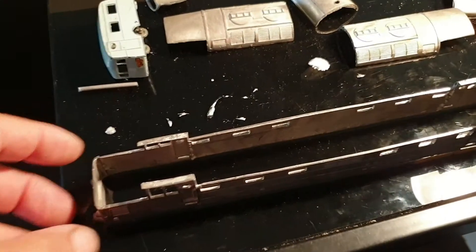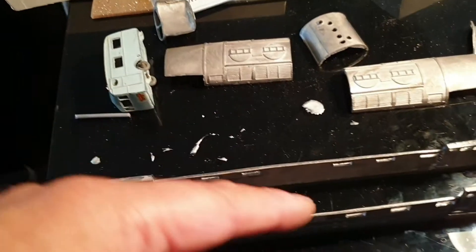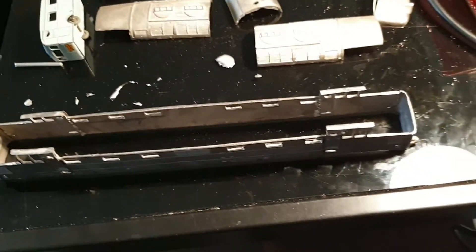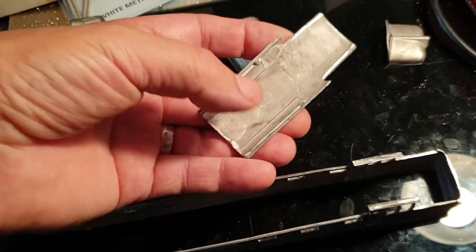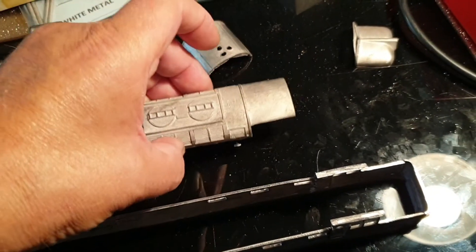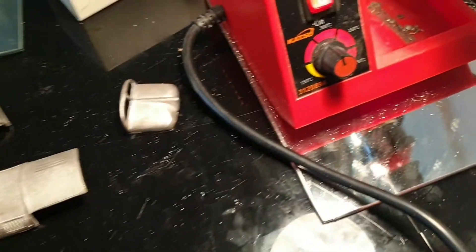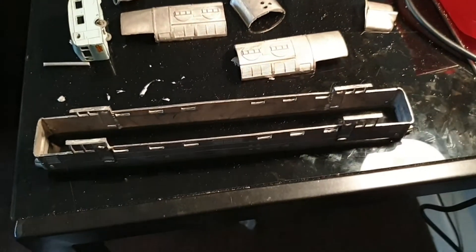I've now actually soldered all four corners with tacks and it's all nice and square, level, flush at the sides, and nice and straight right the way through. I used this just to support the center of the body as I soldered the ends, to stop it from dipping with the weight. I had to file all these body parts — including these lobes — and clean up all the edges to make it solder nicely together. I've got my soldering iron about halfway, because this is a temperature-controlled one, and obviously low-melting solder so you don't melt the body. It's going together quite well.